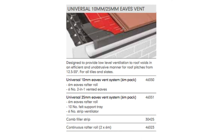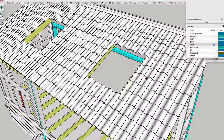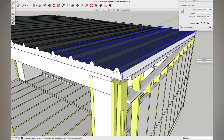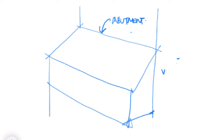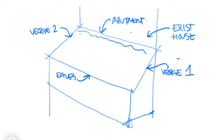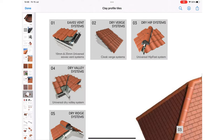Check your manufacturer for that instruction. Using the length of your tiles, just work your way up the roof fixing the battens over the membrane. To help you, you can either use a free program like SketchUp or do it old school with a pen and paper. I've made plenty of videos on using SketchUp so just click on one of the links here. Now let's have a look at our roof and its junctions. Here we have an abutment where it meets the existing wall, eaves, and two verges at each side. There are standard details for each of these scenarios, so let's find them on the manufacturer's standard details.